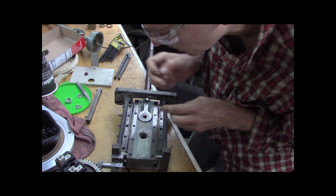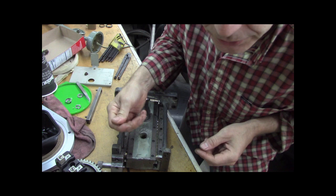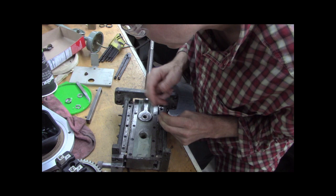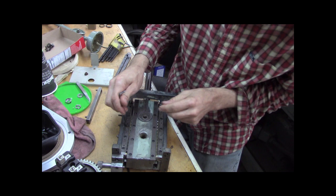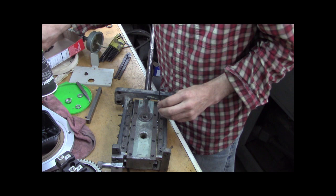If you got a four flute tap, it kind of crescent shapes the back relief of each flute. Or if you've got a countersink, you can back those off. At work, we do zero flute countersinks with the hole. I think MA Ford makes them, or I forget who. And we use an eccentric relief attachment on the universal tool grinder. So the backing off or relieving attachment had this same structure. So I think this is sort of part of the legacy of the backing off relieving attachment. And they just decided the construction was so similar for the backing off attachment that let's just make it a taper attachment also. So that's kind of neat, I guess.